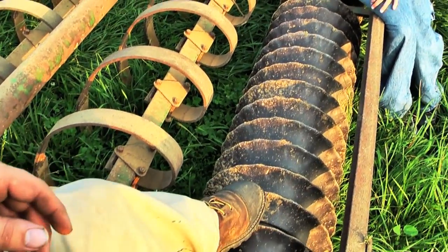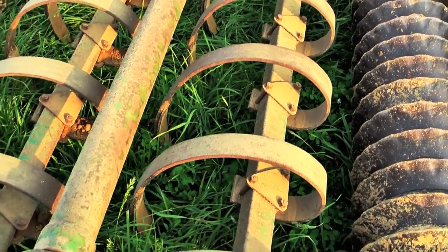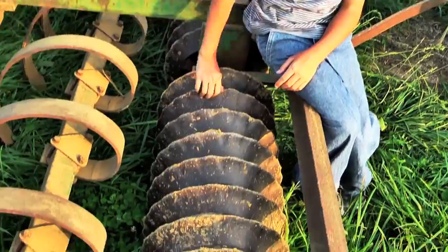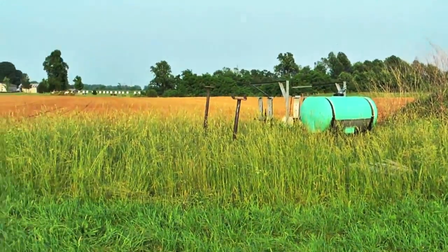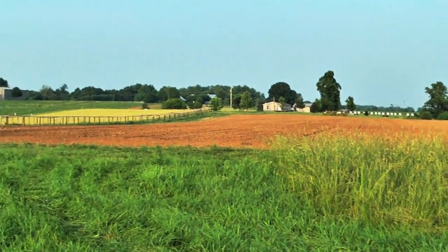This is a John Deere culta-mulcher, about 14 feet wide. It has a row of rollers in the front and these rollers smash the clods up. Then it has two rows of field cultivators and there's a lever so I can adjust how much or how little shovel I put in the dirt. And then there's another row of clod smashers in the back. This is a rigid machine — the frame does not flex across the width of the machine. For that reason it will level up any ridges or divots in the field across its width, so what you're left with is a flat field. If the disc creates some ridges or uneven places, this will take them out. We like that because we like to drive that tobacco setter on flat ground.